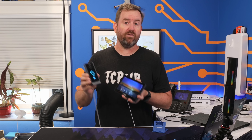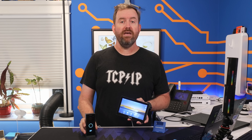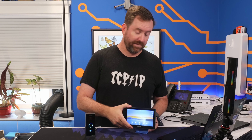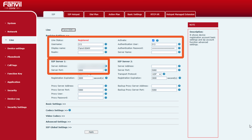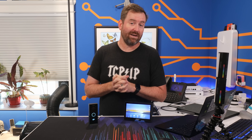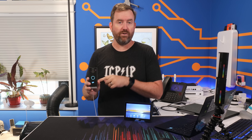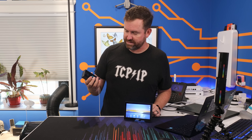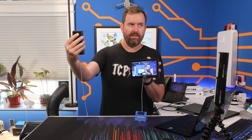When you add a SIP server in the middle — in this case, both are connected to a Crosstalk hosted FreePBX system — you really get a ton of extra functionality. The first thing I did in the PBX was set up SIP extensions for both of these devices, then I added the SIP credentials for the FreePBX into each device. You just log into their portal and add the SIP credentials and they connect right up to the phone system. Once set up, when you press the button on the video door phone, it places a call to the indoor station, as you can see here, and then we've got our video.